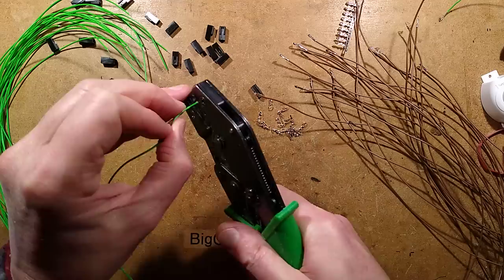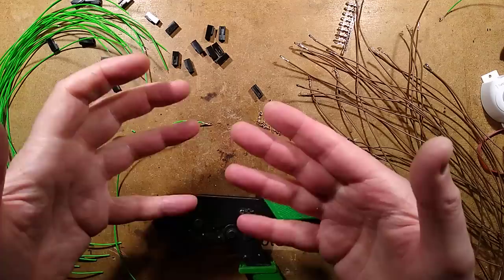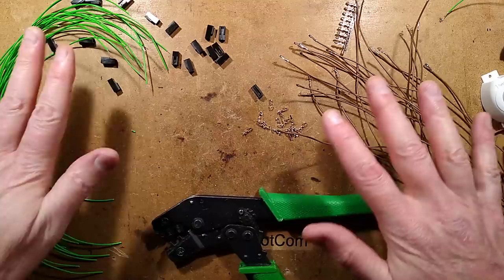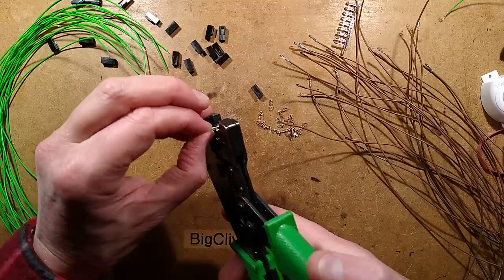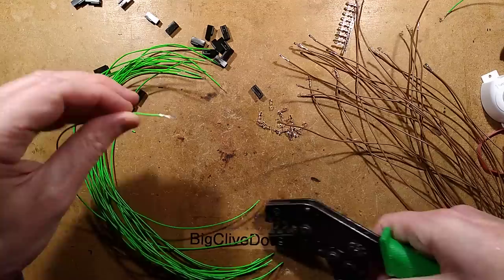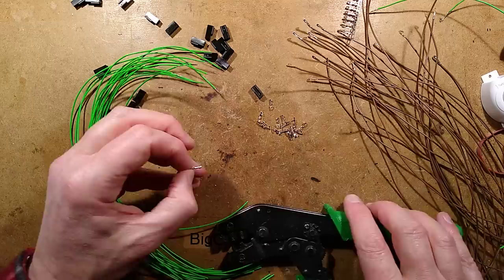As you may have seen in my spam electrocution video, the juicy meat inside you is very, very conductive, and the only thing insulating you is the environment you're in and the layer of dead skin cells. If you lick your fingers, that makes it worse. I'm guessing that guy was in a fairly isolated environment, but you can't always rely on that. If you got used to dabbing wires and feeling if they were tingly, you might do it while standing outdoors in the wet, and that would suddenly be a terrible experience. Water and ground coupling makes a massive difference — even wet wood or concrete makes a massive difference.